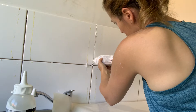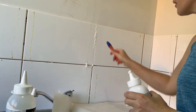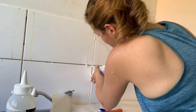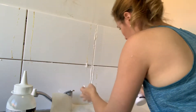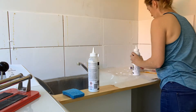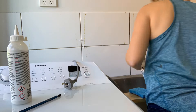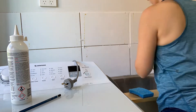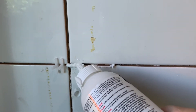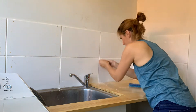I think it's turned out pretty well. I also got myself some pre-made grout — about $11 a bottle. Yes, you could make this yourself with grout powder and water, but for such a small job this squeeze bottle makes it easy to get right into those joins. Squeeze it in, smooth it out, and for some joins you may need to add more and push it down. I let it set for a few hours, came back, and where there were gaps I added some more grout.